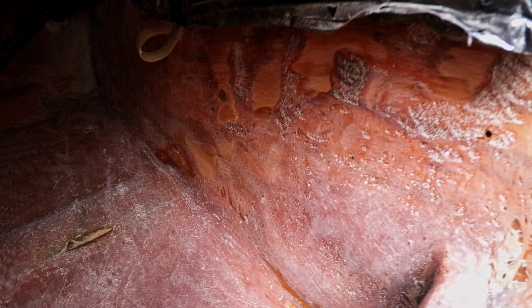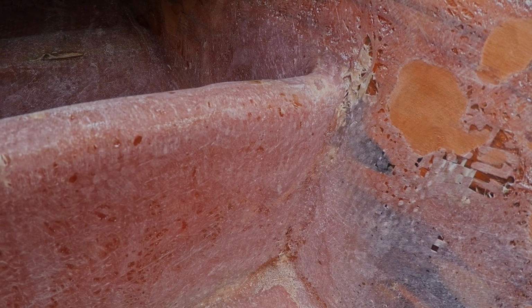The bulkheads and stringers need tabbing, glass, and bilge paint. And there's exposed wood from a strake that needs reinforcement. On the water, this part of the hull can hit very hard coming off the top of a steep wave, so I'll definitely address this. You can see how thin the glass was installed in 1993. Three or more layers of 1708 will greatly extend the life of this boat.